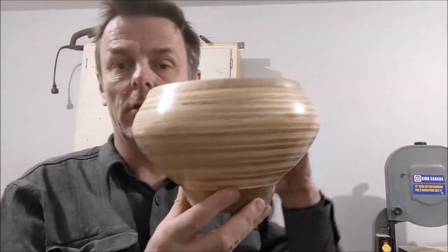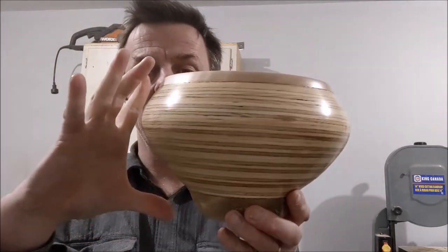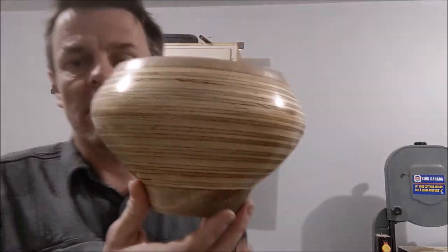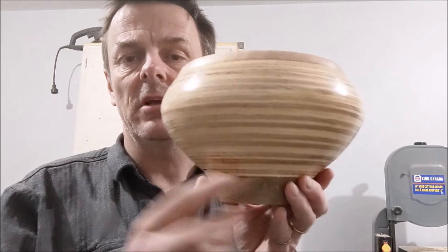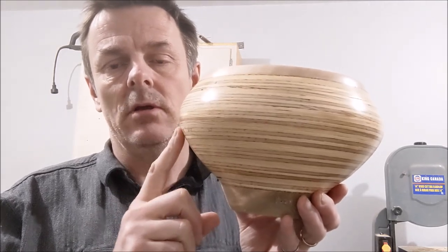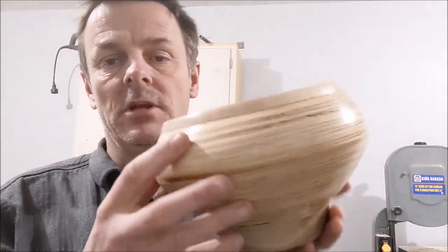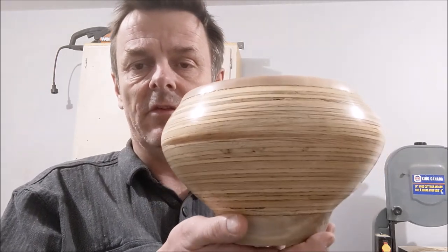Here's the finished product — a plywood bowl. I'm quite pleased with the way it turned out. At the widest part it's about 10 inches in diameter and about 6 inches high. Very nice markings, and it's got a pretty good shine to it as well. Even though it started off as what seemed like just scrap wood, it turned into a very nice product. It's got 5 coats of polyurethane lacquer sprayed on inside and out, rubbed with steel wool between each coat, and then finally buffed on the lathe. Hope you enjoyed this — leave a comment, provide a thumbs up, and if there's anything you'd like to see next, feel free to leave a comment.